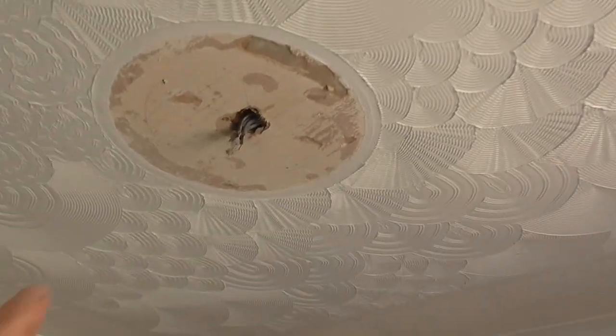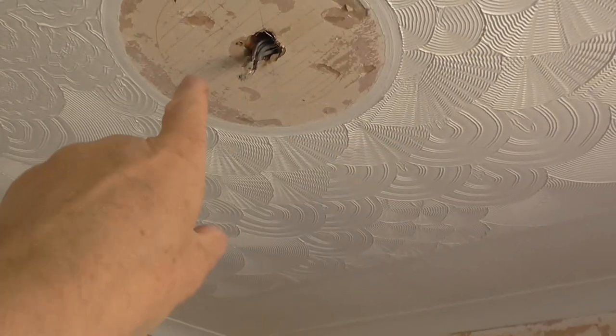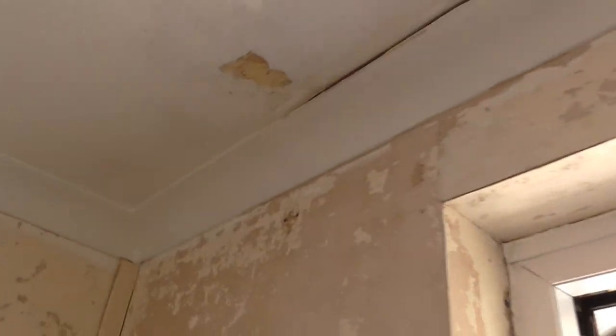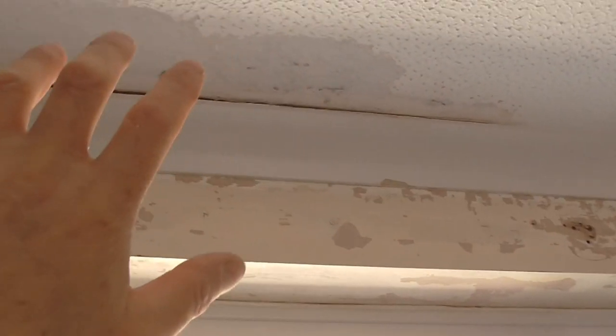Again there's still a lot of sanding you need to do, starting from the top down. Getting round the ceiling area - this row's not too bad, needs a little bit more of a scrape off, light sand down, coated diluted PVA and then some filler just to smooth it out before it gets the Artex. Moving on - the ceiling itself has all been dusted off. Moving on to where that leak was, I've scraped it all back, all the loose, and I'm going to put some foam in the coving there to help secure that. Do some filling on that before the Artex.